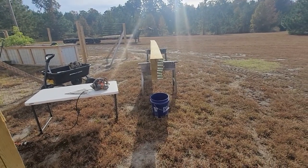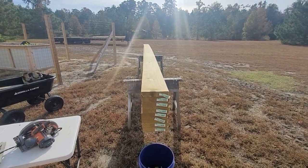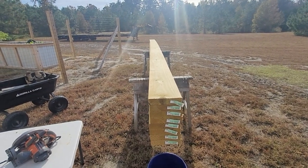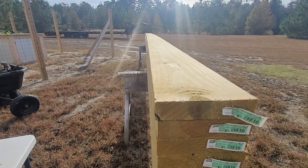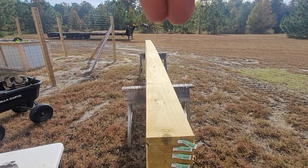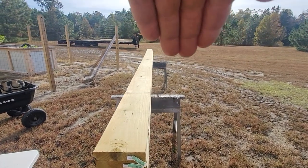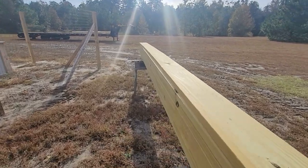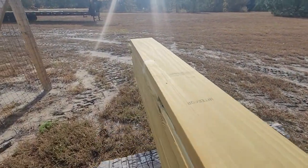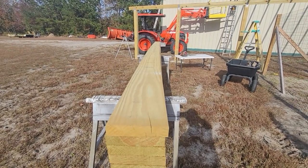An important thing to show here — boards have what's called a crown. It's kind of like a bridge — it's higher in the middle, it kind of curves. That's a good thing because as the load settles on it, it will flatten out, and you want to make sure the crowns are always up. It's hard to explain what a crown is, but if you can see how much this board curves like this, that's a good example of crown. Now that's way too much — you can see they're flush on this side, and if you look over here at the space, you'll see how much of a crown this thing has. That's what crown looks like.